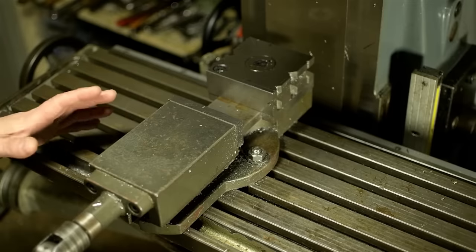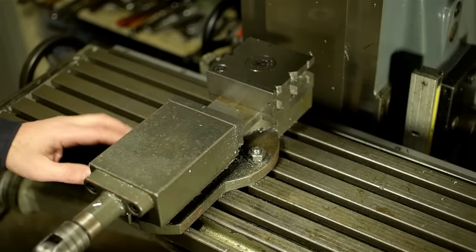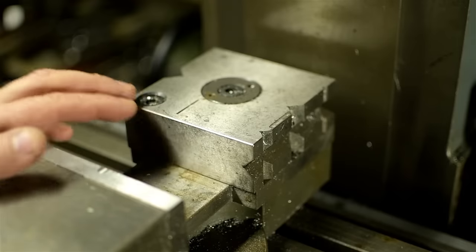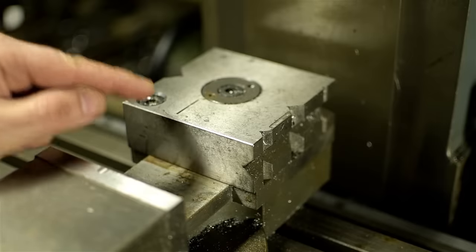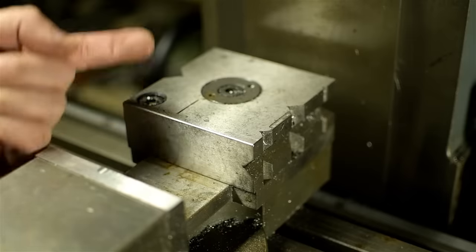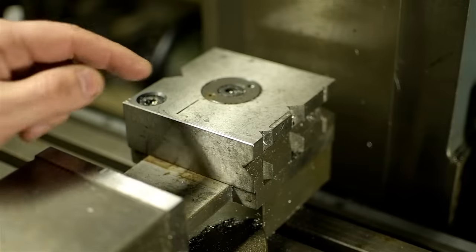And 100% transparency here, this thing has picked up a bit of slack in the fixed jaw, and for the life of me, I can't figure out how to tighten that out. If I hold work too high up in the jaws, I pick up a lot of deflection from this fixed jaw, which ends up in out of square parts. I can't figure out how this fixed jaw is attached. There's a bolt in the top, some kind of adjustment nut, another bolt from the bottom, but everything spins when I try to tighten it, and nothing gets tighter. That, however, is a story for another time.